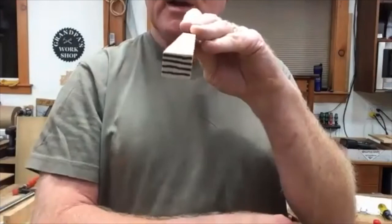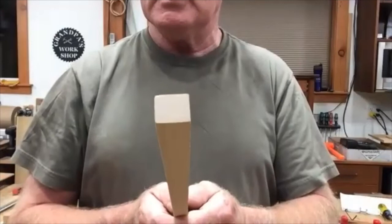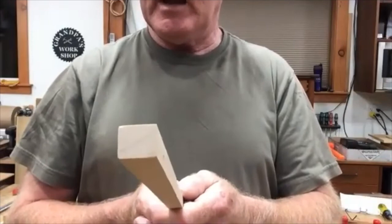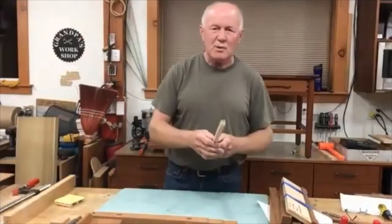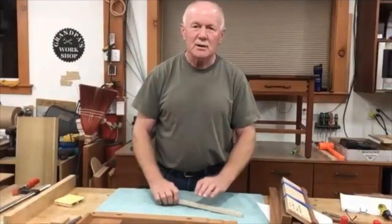And again, it's a hardwood. I never finish the wood, I'll wax it only. But good hard maple or quarter sawn white oak. It goes on after the finish has been put on the piece. And I only put wax on it. I use Renaissance wax, but whatever paste wax you use. Put it on the inside of the dado and put it on the runner. It works slick.